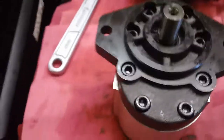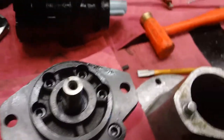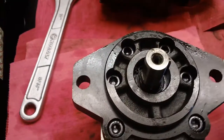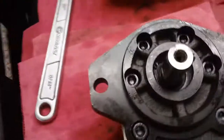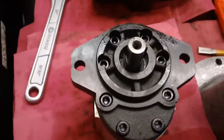Now this will show you the rotation change. We've removed the cap so you can see the larger port. The larger port is now on the left with the shaft facing your nose and the belly of the pump down. The smaller port, which is your outlet port, is on the right. This is now a clockwise rotated gear pump.